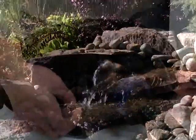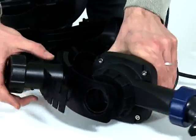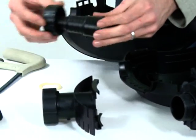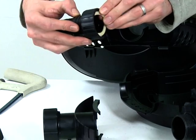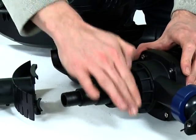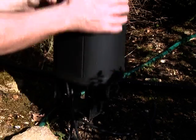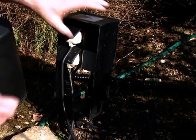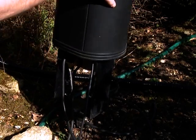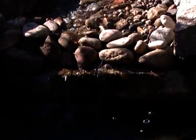Ensure the hose is connected to a filter if required or to the top of a waterfall. If the pump is to be dry installed, remove the pump from the strainer casing and remove the second inlet connections. Cut down the shorter stepped hose tail to the desired size and push through the retaining nut. Insert the white flat gasket into the retaining nut, then screw onto the inlet thread. Connect to the inlet pipework and ensure the pump is mounted horizontally below the water surface level. Connect the power supply and check for operation. Check for leaks at the filter or the top of the waterfall to avoid any water loss.